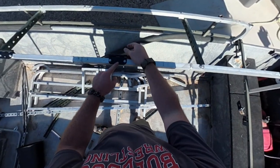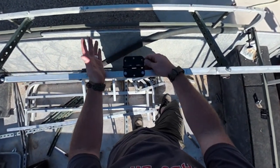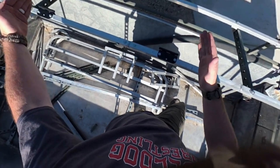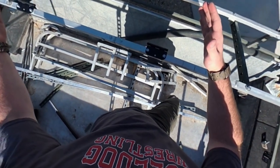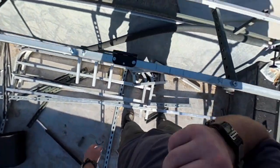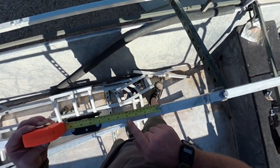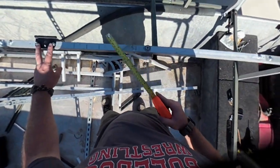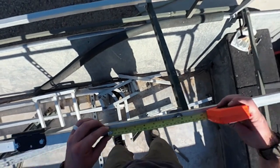I've got 4-inch gap between where my quarter mark is, 4-inch gap here, 3 inches from that I've put this hinge in. Now the important thing about the hinges is that they have to be as close as possible so that when you put your blind flaps on, they're not crooked, they're not bending incorrectly. You want them to be as smooth as possible. And hinges can be kind of tricky. Taking my tape measure, I know that I have my 4-inch gap right here, okay? So from this side of it, because I already have this one, this will be door number 4, I go 3 inches from that gap right there.